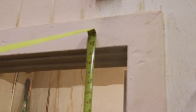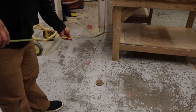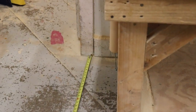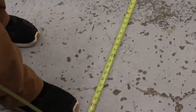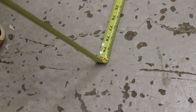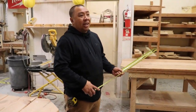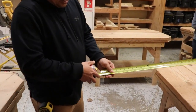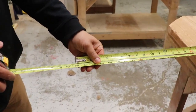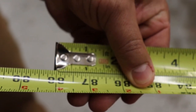When it comes to measuring stuff like a door height, you always want to bend the tape and measure from the floors — stay off your knees if you can. If I want to measure to the top of that trim, I bend my tape like this and measure like that — it's going to save your knees, save your joints. I'll put this up against something and point it out to a spot, and I'll just say whatever: 81 inches. I'm not getting on my knees constantly. The best thing about this tape: if you want to find half of 88 inches, you put this on 88 — it should be 44 down that end. Bend the tape down to mark on 88 and look down that end, it says 44.